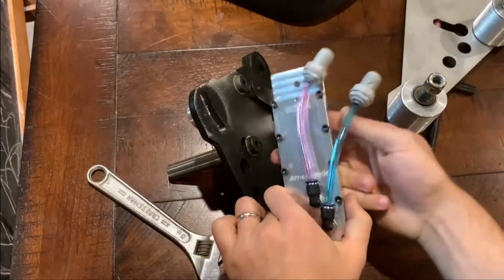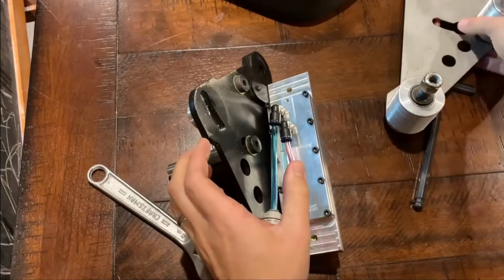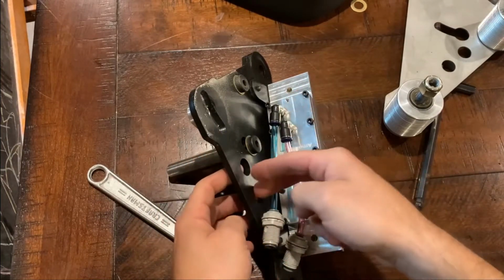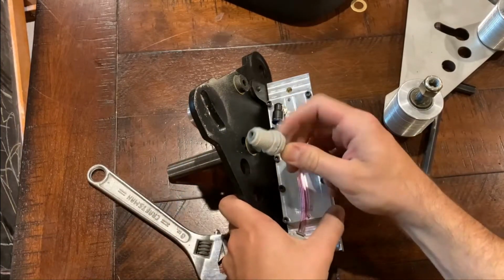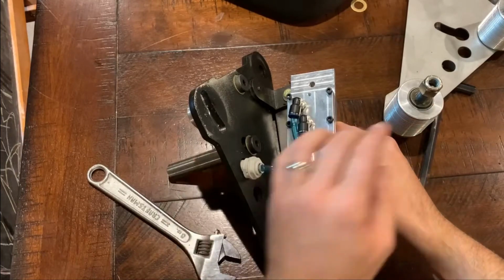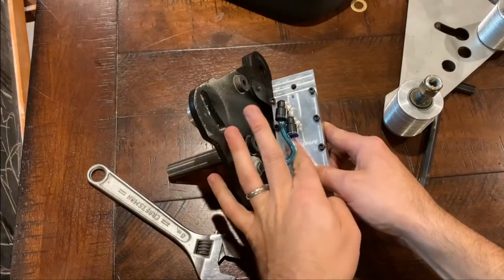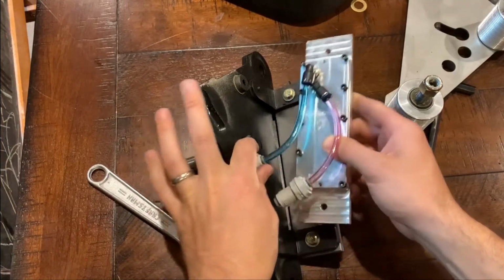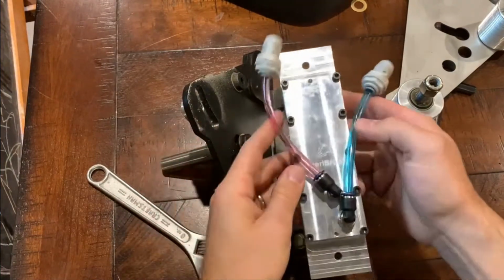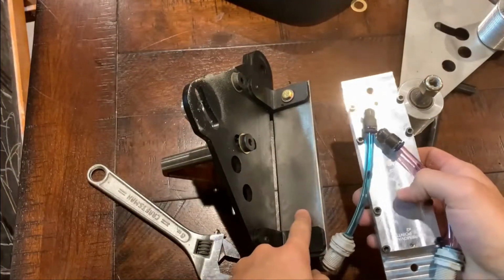As far as orientation, this way versus that, it looks like this way is actually better. There's 2 holes on either side of the platen that go like this, and I think those are designed, it actually says right on this piece, that this is designed for the chiller lines to be run through. So with the lines as they are, I think this orientation's better. If you do this, they get kinked off, and you have to make some extreme angles to get it to fit. So I'm going to go ahead and take this off.